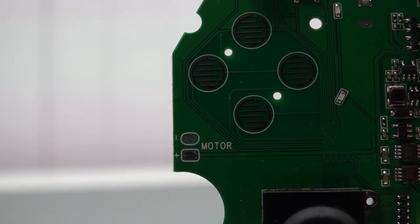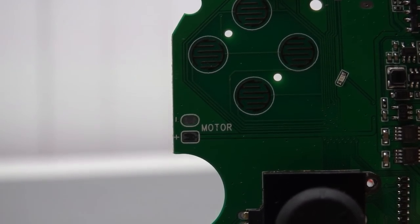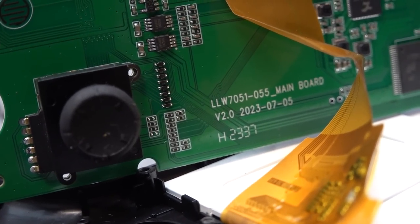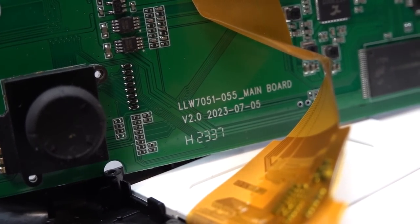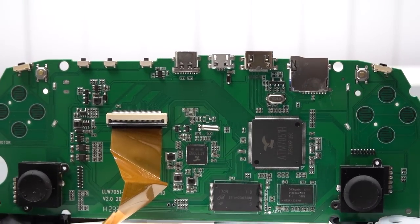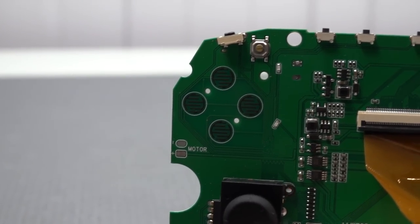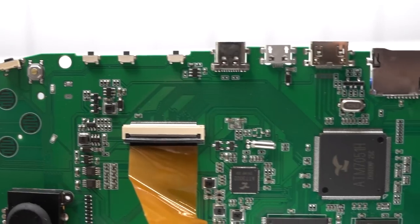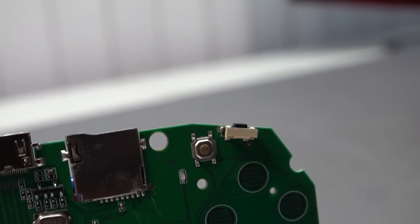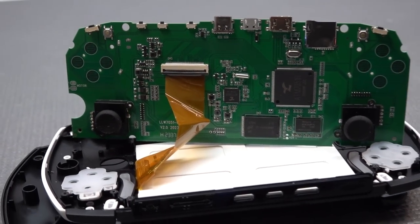Interestingly, this device has the option for a vibration motor - there's a motor connector with plus and minus - but they didn't implement it. I think it's just cutting corners and saving money. The mainboard was produced on 2023-07-05 and it's already version number two. It is one huge PCB constructed for this piece of equipment. Then we also get micro switches underneath, and there are a lot of parts you need to desolder if you need replacements.